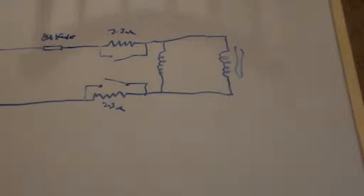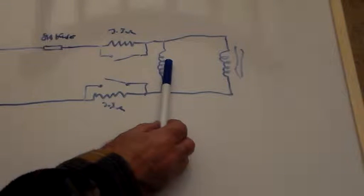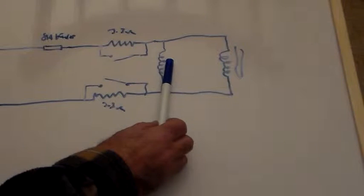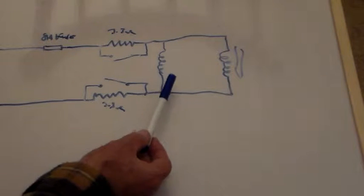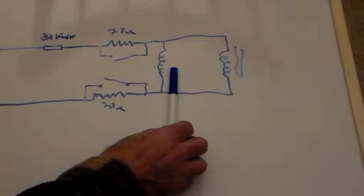Right, back to the circuit diagram. And what I need is something a bit smaller. Oh, here we go. I use the pen again. Right, so what that bloody awful noise is, this relay coil, the specification for it says that it picks at 192 volts. I actually tried it with the Variac. It picks at about 140, 150, and it starts thinking about picking at about 130.